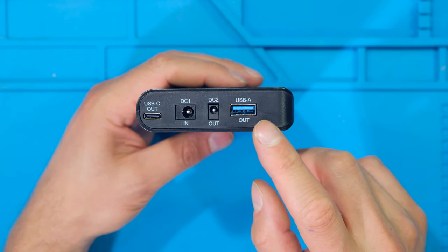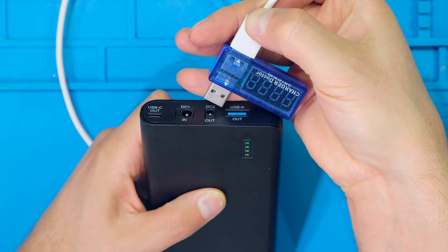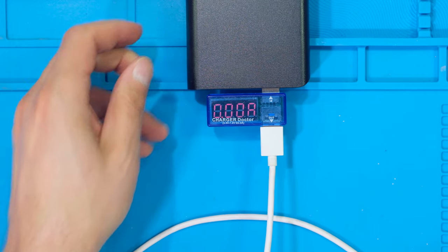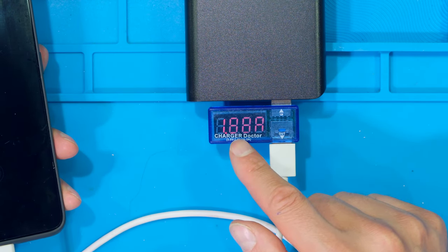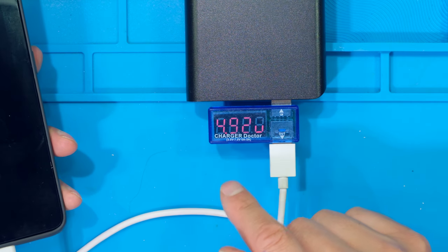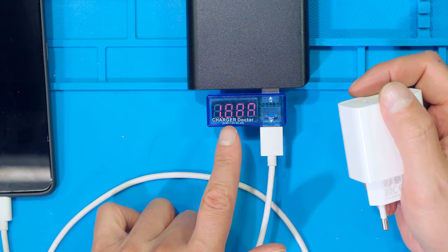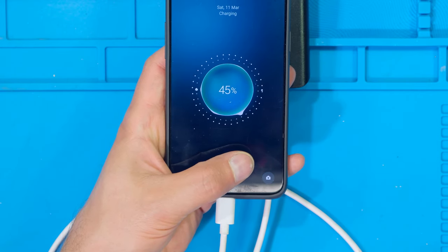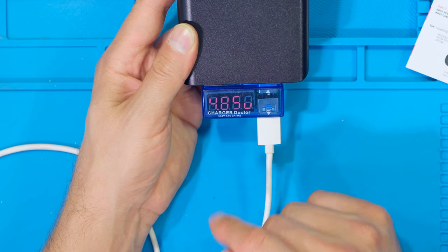There's also a USB-A port on the side which can be used for charging your cell phone. I have a little USB port monitor which can measure the voltage and current coming out of the port. I've plugged in my USB volt and current meter and I'm connecting it to a cell phone with a 5,000 milliamp hour battery. The voltage is 5 volts and the current is building up to almost 2 amps — 1.9 amps. I'm satisfied with that because even when I connect to a dedicated charger over 20 watts, I also get a maximum of 2 amps at 5 volts. My cell phone is at 45% and charging, though the current does tend to drop — it goes to just under 1 amp, but it is still charging.